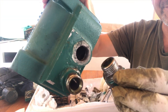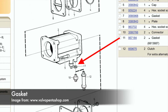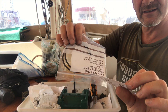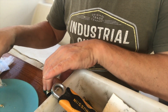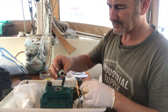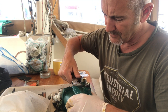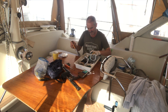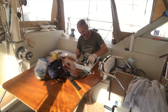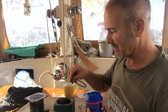I just need to get this gasket off — it's this washer thing, it's been a bit misshapen, been over-tightened at some point, so I'm going to replace that as well. I ordered these off Voltec in the UK — there's the oil seals and there's the gasket or washer that goes on the inlet. I'm just going to use a bit of Vaseline, a bit of petroleum jelly, just to stick them in place and make sure those seals are nice and tight.